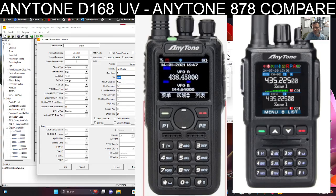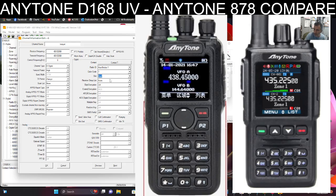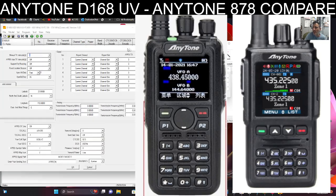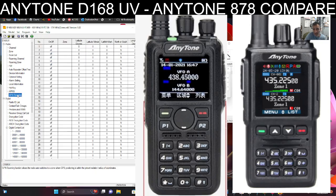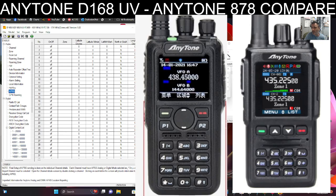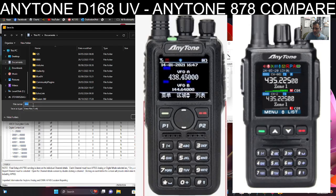Slot 1 or 2 — a slot is half a channel, which means you can pass data and voice communication using just half the channel, which is very handy. You can select groups if you want digital, set your transmit power, and set time-out — how long you can talk for. APRS settings are in a completely different section. There's definitely a learning curve to APRS when you're on DMR, but GPS settings are all there too.